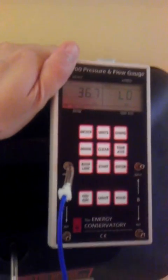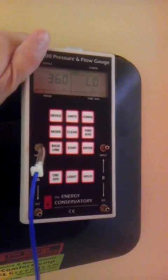As you can hear behind me the blower door fan is still running. So I'm going to test these two crevices — I put my hand on there and you can feel a lot of air coming in. Obviously the wall cavities are hollow and they are connected to the attic which is vented to the outside, so you're going to bring hot air into the home while you're cooling the home. I'm going to go ahead and place the pressure pan right over it here. And if you look over to the left you can see that I'm at a 36.2 — so all that is air that is coming into the home.